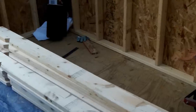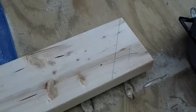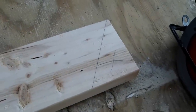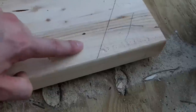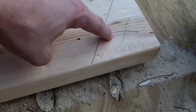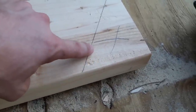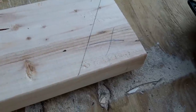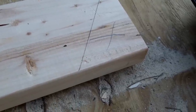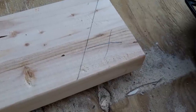You'll see the cuts here. There's the cut for the ridge — that's at the angle you want. From this angle right here, this is the angle of your roof that you're going to want. For mine it was 37 degrees — it's close to a 10 and 12 pitch, but not quite. It's probably somewhere in between.